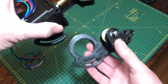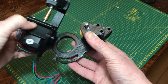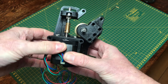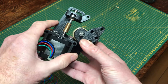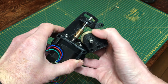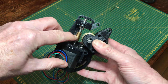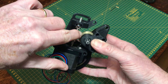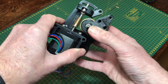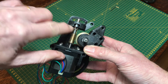The next task is to mate the motor holder and this sub-assembly together so they'll engage through this little circular hole at the base. They should clip together quite nicely, and you can see that we can adjust everything here — the position of the shaft, the drive wheel, and the angle between the two — so that the drive wheel, this worm gear, and the brass cog that it engages with will all knit together nicely. The worm gear can be slid backwards and forwards on the shaft so that you get a correct engagement against the gear wheel.